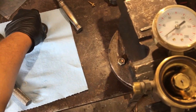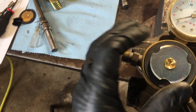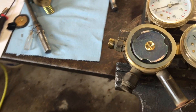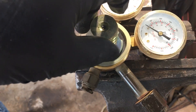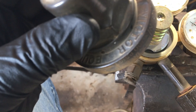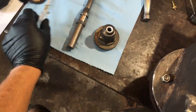Hopefully clean hands here — everything should be clean. Now we're ready to put in the diaphragm; this is the new one that came with the kit. We've got a washer that goes on top of there. Next we've got our spring and our plate that rides against the adjuster. This will all be centered up by the cap whenever we put it down on there — it should center everything up. That's pretty much it.